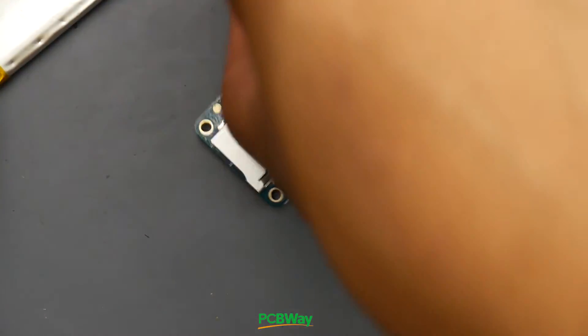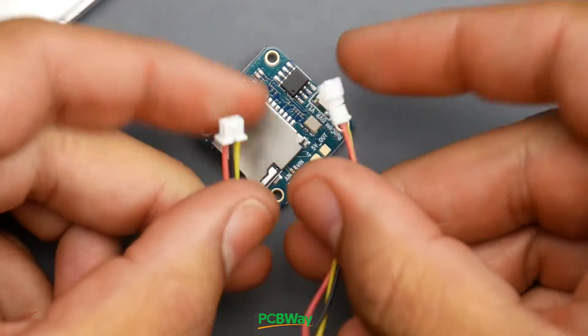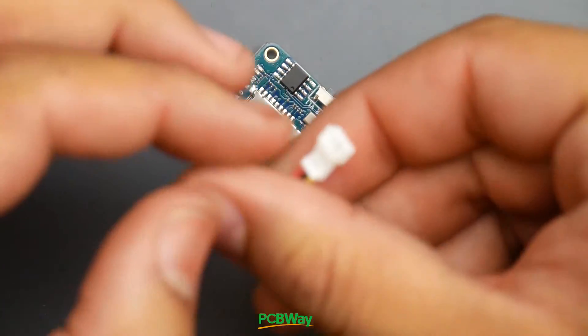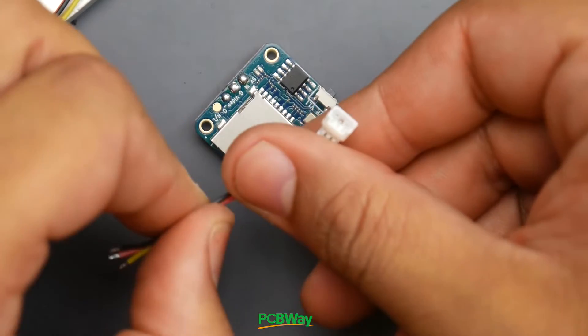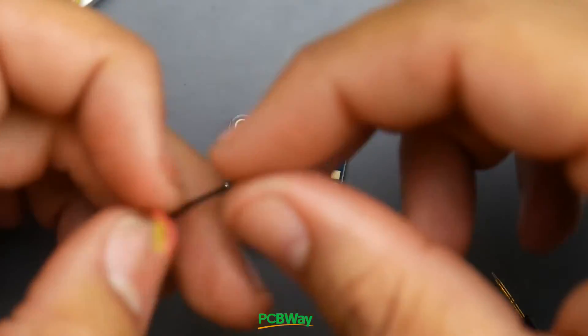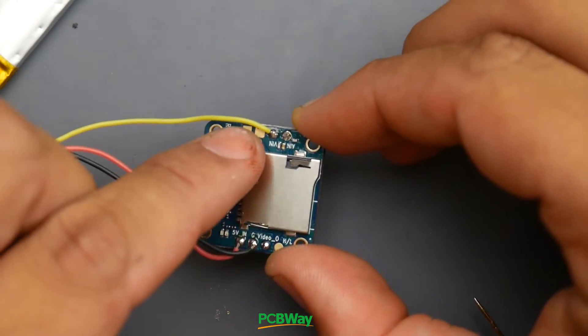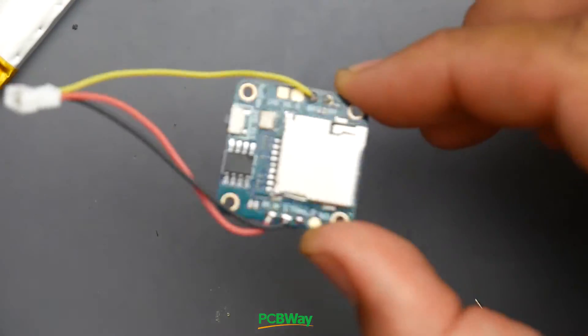So the next thing I want to do is grab the female connector. They do provide you these two cables in the package. I want to grab the female one, which looks like this here, and go ahead and solder the correct colors. So that's done here — we have the 5 volt in, ground, and the video in, which is VIN. Very important. So we're done with the DVR for now.